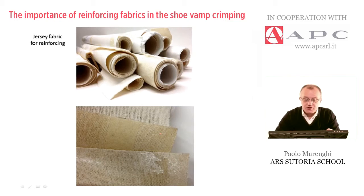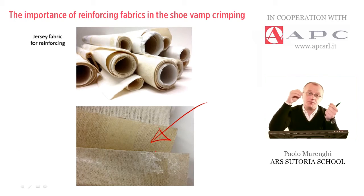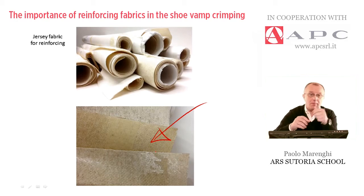As we have seen in many other cases, one side of this material has been coated by glue — could be EVA or polyurethane — and generally these types of materials are never self-sticking. They must be heated because the glue has to penetrate into the piece to be molded.